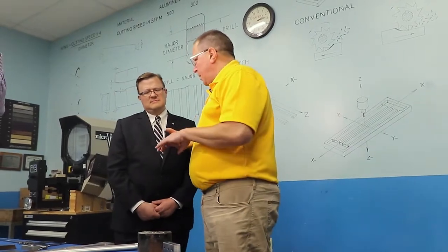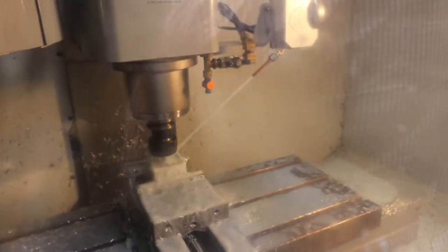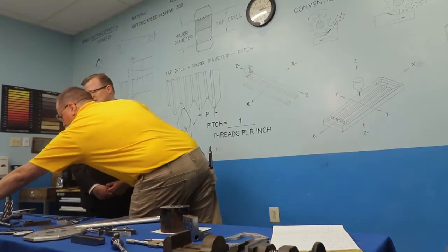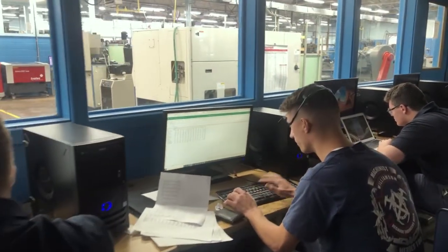And at the senior level, they have metallurgy projects they've got to get done. They have tool design projects that they have to complete. And they have CNC projects. The tolerances keep getting tighter and tighter at the senior level. In the grinding area, we're talking plus or minus 5/10,000. Now you have to keep in mind the human hair. If you get a micrometer reading of the human hair, it's about 3/1000. And then they have CNC projects, computer numerical control. They learn how to do manual programs.